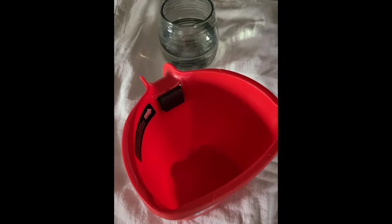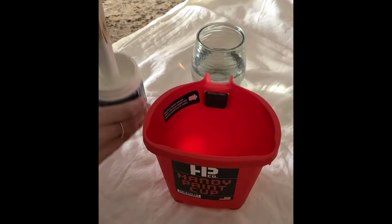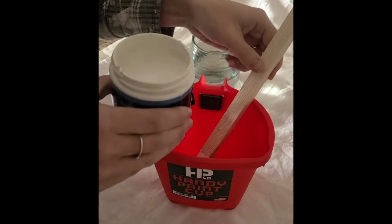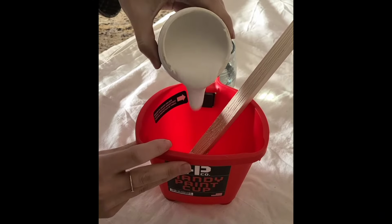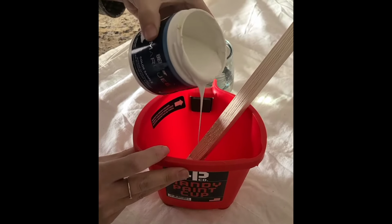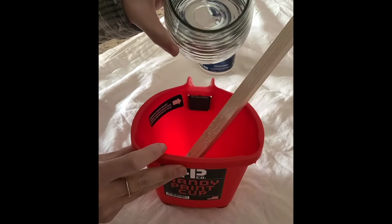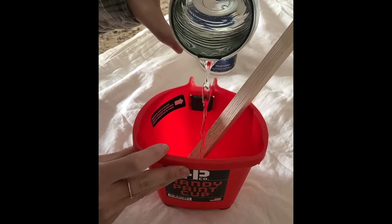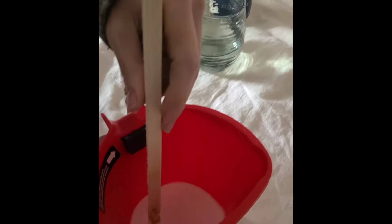After the wood stain has dried, you can move on to doing the watered down paint. We're going to mix the white paint with a 50% ratio with water. The watered down paint gives it that wash characteristic that we're going for, meaning that the paint coverage is going to be semi-opaque and see-through. So even though paint is applied over the stain, you're still going to be able to see that wood grain. You just want to start by mixing the paint and water.